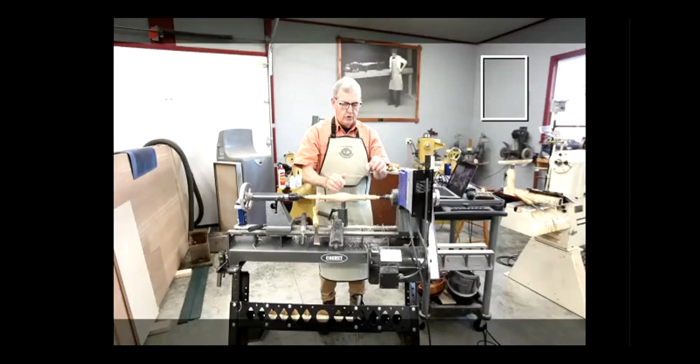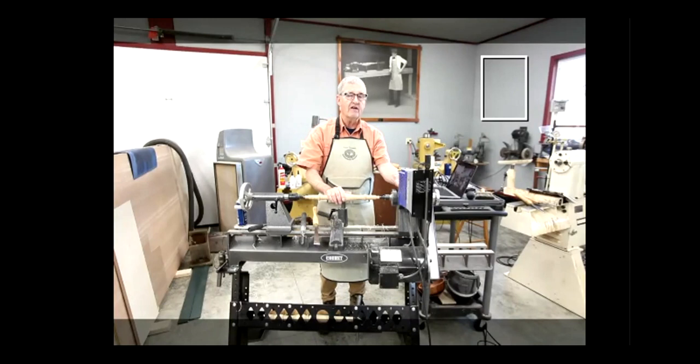And then I put a piece of wood between centers, but in such a way that I had the same grain as I had there, which was a little off of end grain. It was just slightly, and it was the same material. And I turned that to the diameter of that hole, put some glue in it, pounded it in there, put it back in the lathe and turned it off level. And today I was gonna take a picture of it with my iPhone this morning, I couldn't even find it. So you can do some very effective repairs that way.